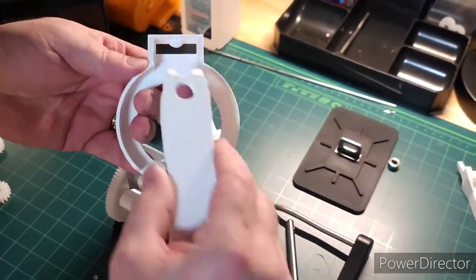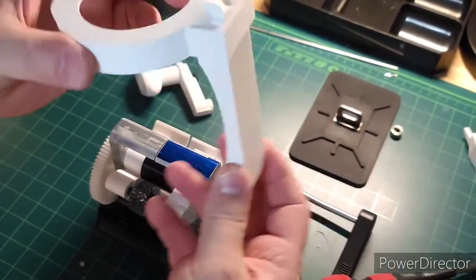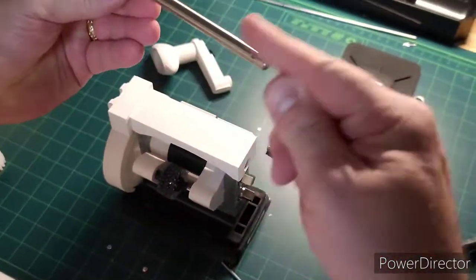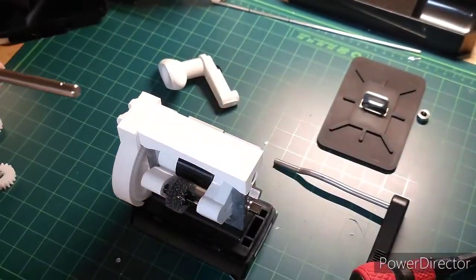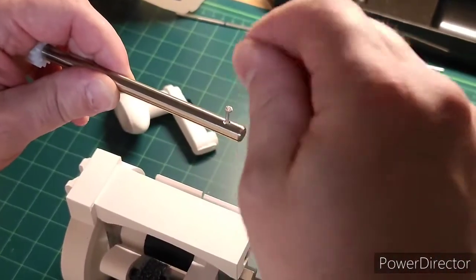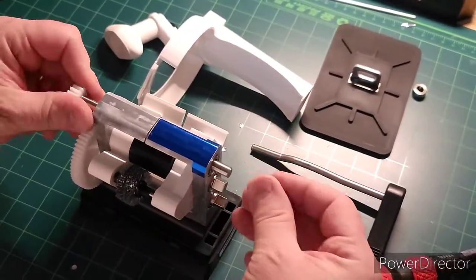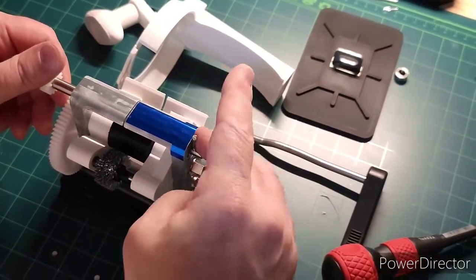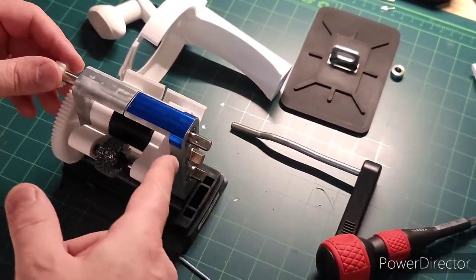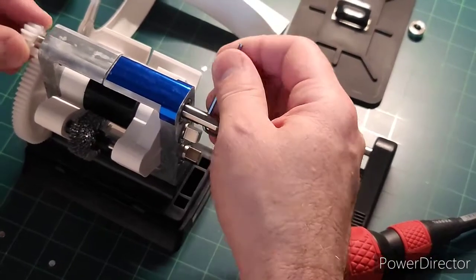This is the top and this is the side piece — how you assemble it is it just goes together, just like that. This is the gear, this is the handle. What I did is I took a nail about this big and I hammered it through while it was still in the machine — just put the nail here and hammered it against here and it was fine. After that I drilled it with a two-millimeter drill bit so your Allen wrench can fit inside. This is the whole mechanism behind the handle — this is the strength of your handle.